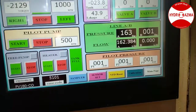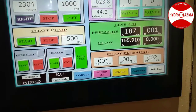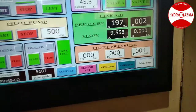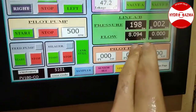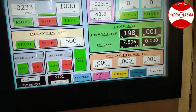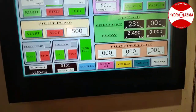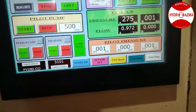We are close to the cut-off. This is the cut-off state and when the pressure reaches this point, the flow of the pump goes to the minimum. This pump has a minimum swash angle and I can't raise the pressure further. But the leakage doesn't allow us to go higher in pressure.